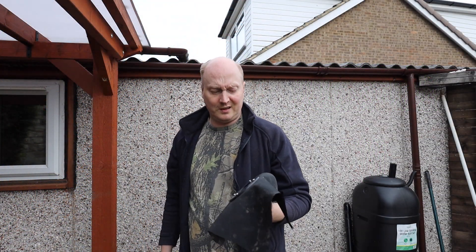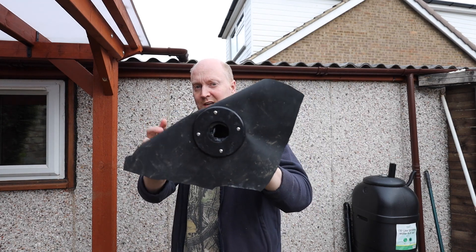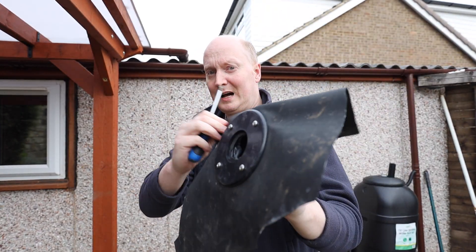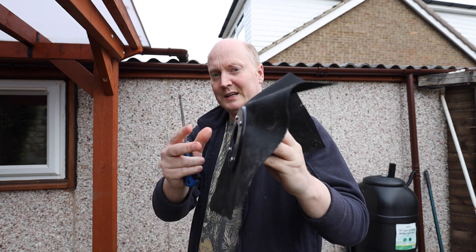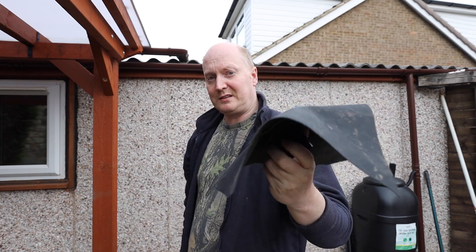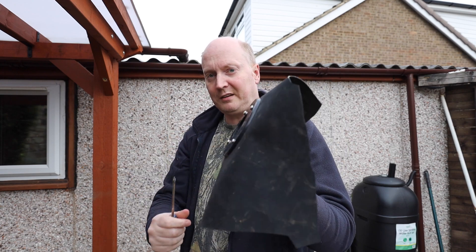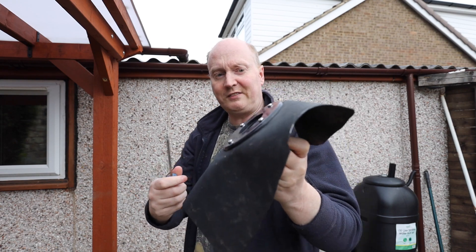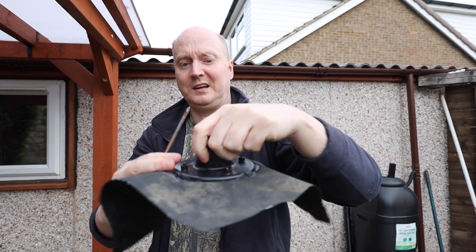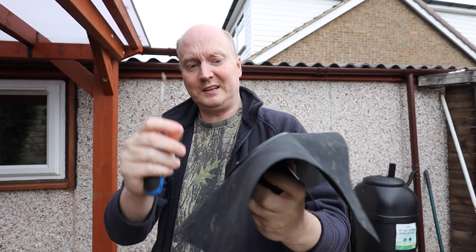Here's another video. As you've seen in previous videos, I've shown you how to do a tank connector for your pond. Obviously that's what one looks like - you've attached that to your liner and then you can connect pipes to the connector on the back as well as the front for connecting pipes and fittings. It should be completely watertight. The way you put these together is quite simple: you put silicon on the base plate on the back, then you put your liner on top of the silicon.